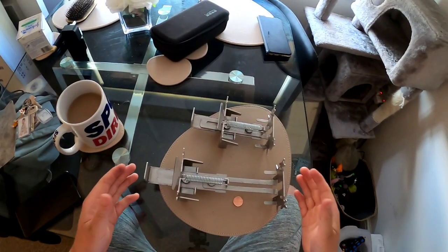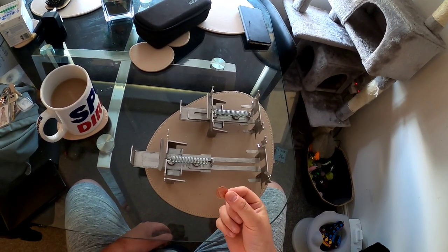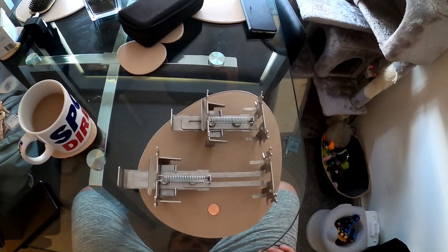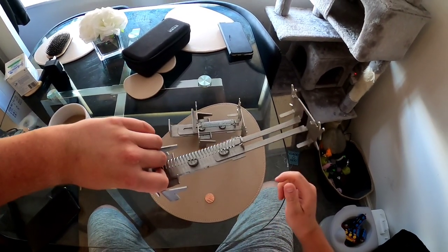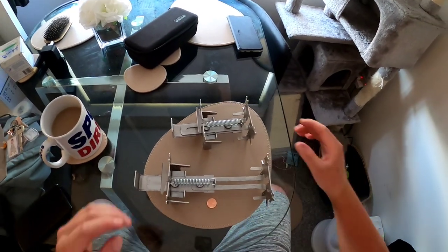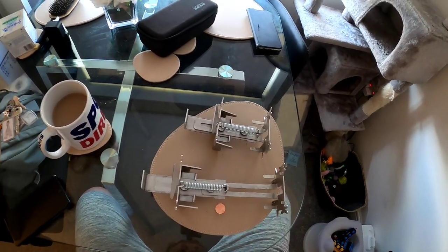Check it out. What you're looking at here is the new Fitzbrick, the new penny clamp Fitzbrick. I'm just using a penny to show you it can be used with a penny, but when you're on site, a slip tie is probably more readily available. So this is the block laid flat or brick on edge 215 modification. And this is the 140 or 6-inch block modification there for the 140s.